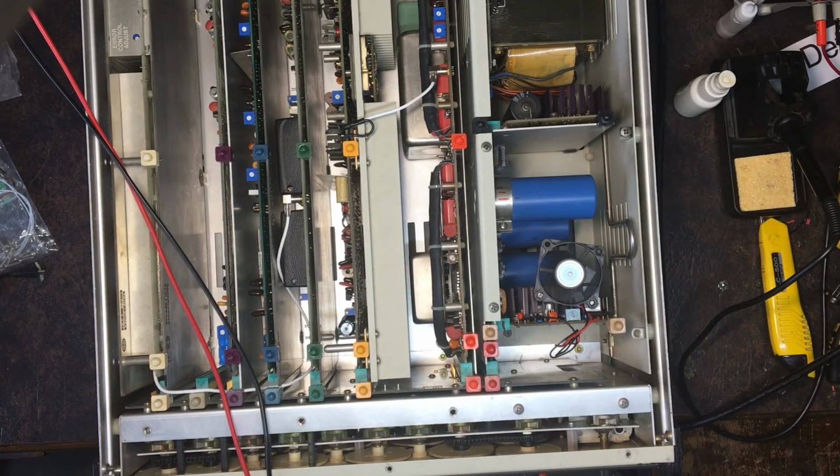Set to 1 volt. I should set it at 1 volt, shouldn't I? 1 volt at 100 kilohertz. So that's what I should get on AC if it's working when it's okay. First I'm checking for DC bias though, because that's an indicator that the thing isn't working. Turn it on. There is no DC bias on any range, so that's looking good. AC volts, I'm on the 1 volt range again, and I'm getting 0.8 volts.